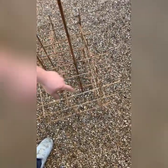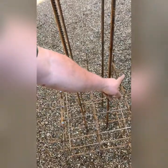Basically the brickwork, like I said earlier, is 560 square, so the brickwork will actually sit right round the outside of them bars. And as we're going up, the pier will get filled up with concrete as well, so it's going to be absolutely solid. So yeah, I'm going to get this one in the other pad now. Leon's busy mixing up the concrete and pouring. So yeah, I'm going to muck in with him now, and I'll put some more pictures on.